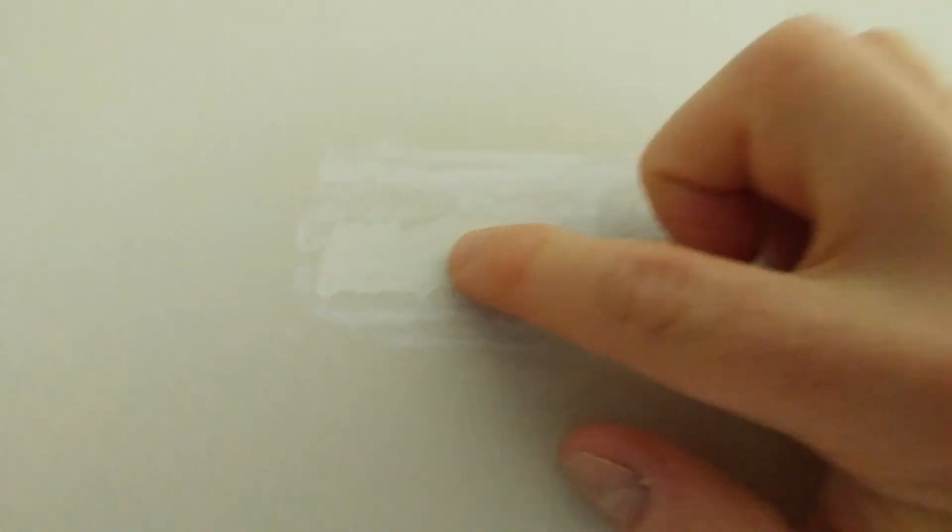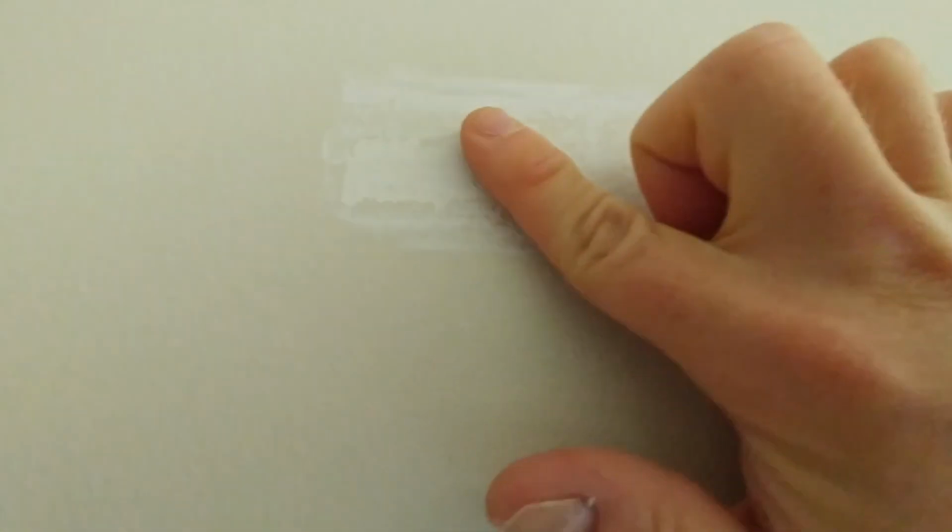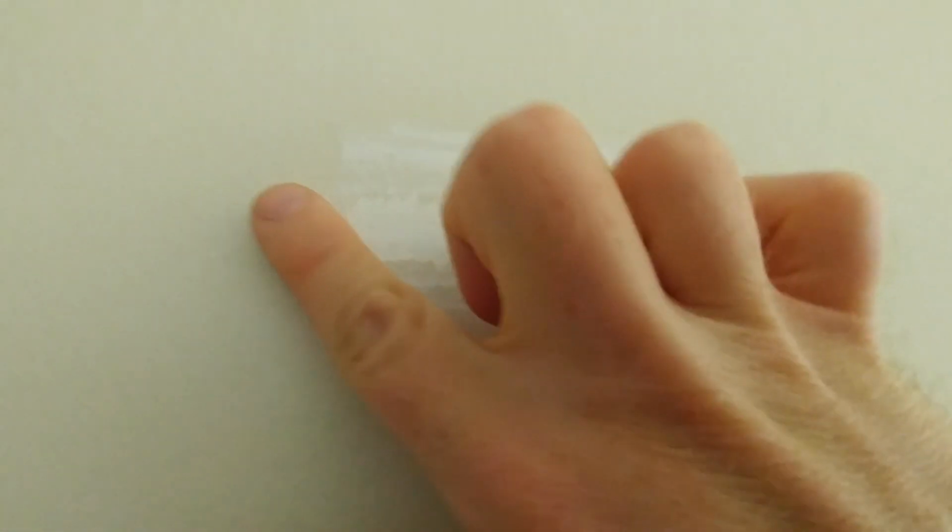It's, I'm sure, primarily meant for nails and screw holes, a lot smaller, but it did fix this with one pass. I could go over it again, but as far as just quickly filling these small nail holes, screw holes, etc., it seems like it did a pretty good job. It was a great quick fix, and it is worth noting again that this is not just spackle, it's spackle and primer in one, which is pretty slick. So they could theoretically now just paint over this in one coat.